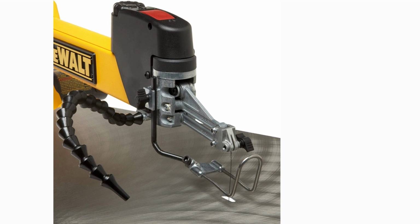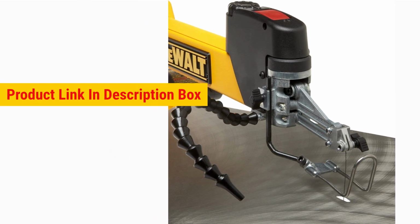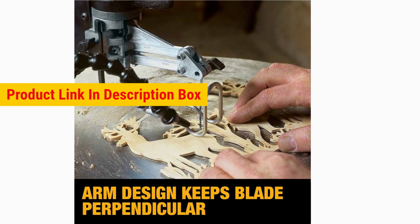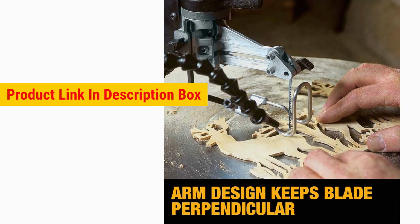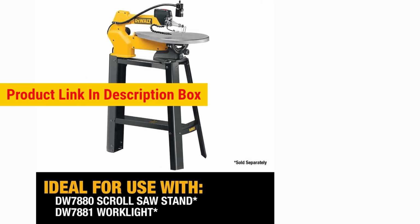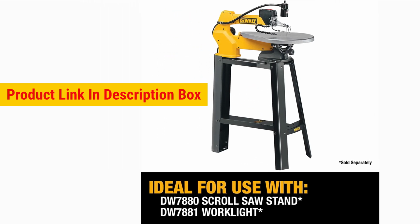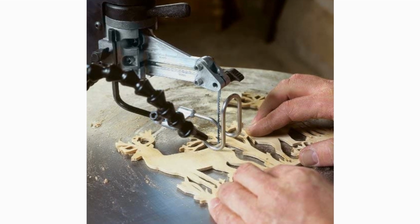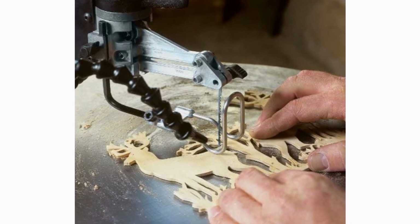The on-off switch, the tension lever, and the speed adjustment are all located on the front of the tool for easy access. This saw has a large 20-inch capacity for cutting large workpieces. Also, it accepts plain-end blades, and blade changes are easy thanks to the toolless blade clamp. Stroke speed is adjustable from 400 to 1750 SPM, making this scroll saw suitable for cutting both softwoods and hardwoods as well as plastic and sheet metal.